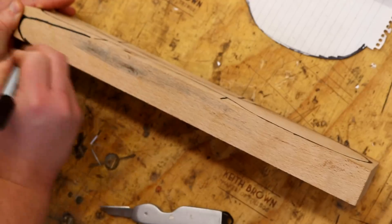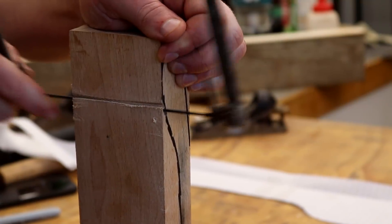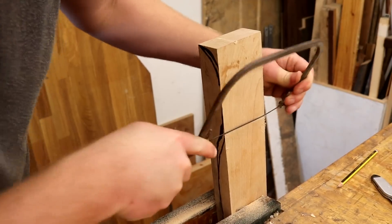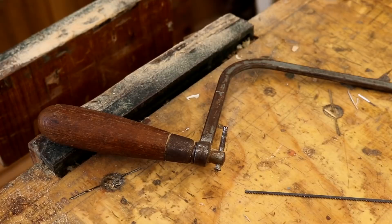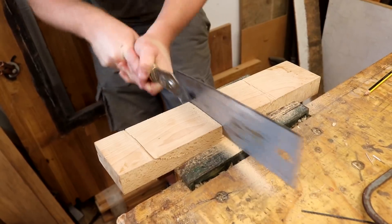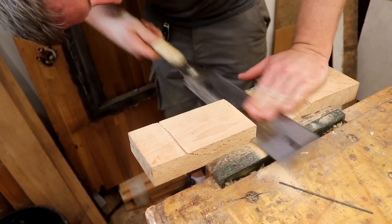I marked up a shape for the profile too. I started cutting the profile first with a coping saw. This took an awfully long time and the temptation of course was just to use the bandsaw, but I stuck with it until eventually breaking the blade in the coping saw. It was the only blade that I had, but I was almost done — probably about 20 millimetres left — so I made a relief cut with my Japanese pull saw and then I could knock out the waste with my mallet, and that gave me the space I needed to get in there to cut the remaining part.